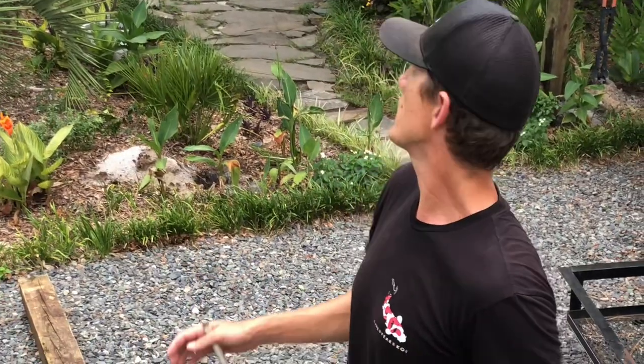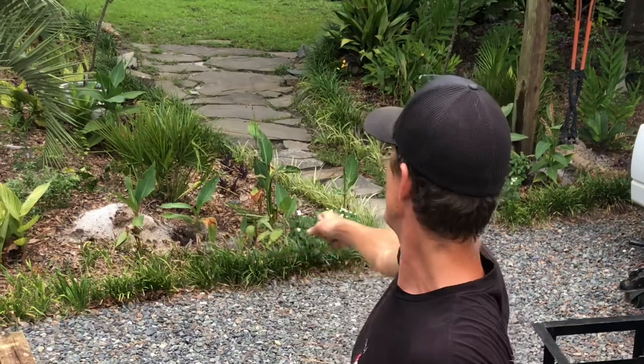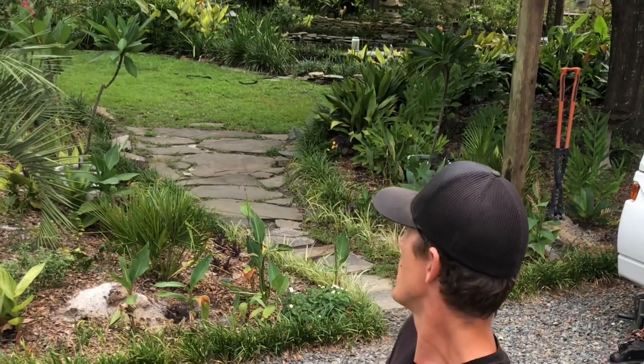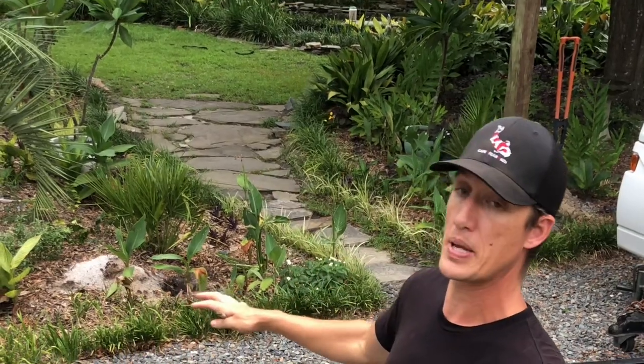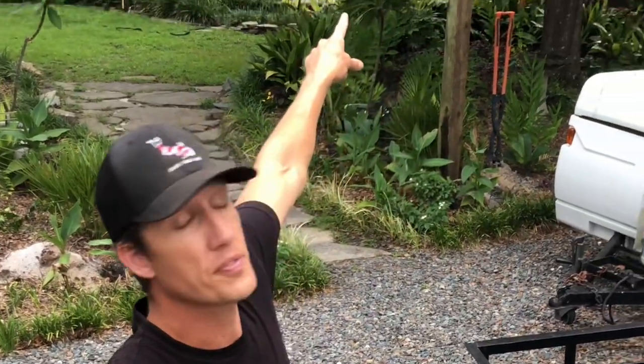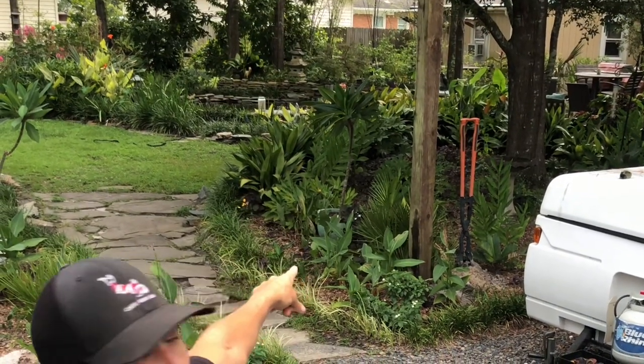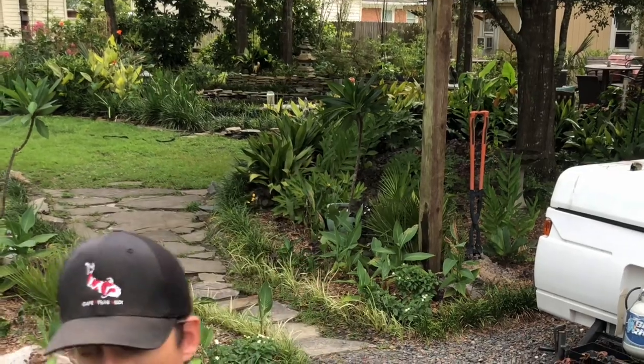So I'm in a kind of a tricky situation where I've got irregular ground right here. So what I'm gonna do is bury all my boards or beams roughly 3 feet, and then I'm going to measure from the very top to 8 feet. So I know I've got a mark over there at 8 feet down from the top. I'm gonna do the same here.